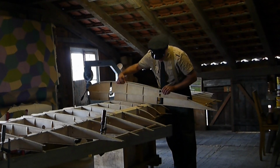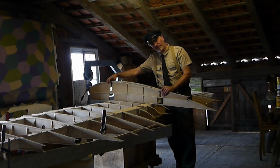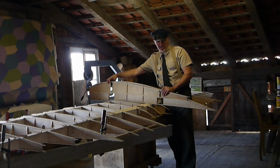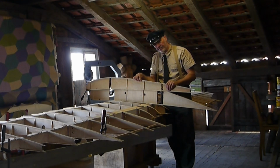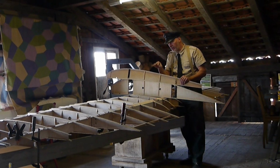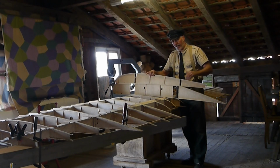And this stretching, if you superimpose it here, means that the flow remains in the outer area for longer. This means that the aircraft has a more docile slow flight behavior and remains controllable for longer, even though the flow on the middle area has long since stopped and the aircraft stalled there. And all this without deforming the rib in such a way that my induced drag increased towards the outside, which reduces the overall speed of my airplane in turn. Very basic aerodynamics, nothing you need to know, just so that you have heard it one time.